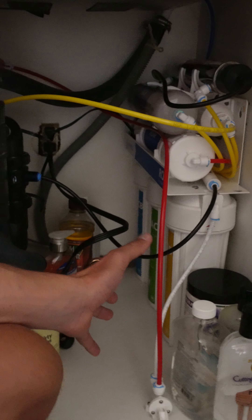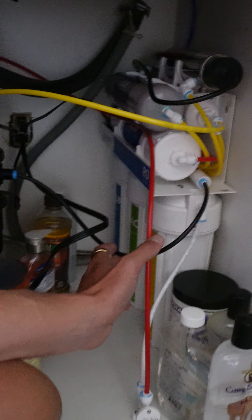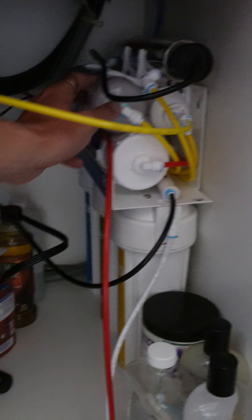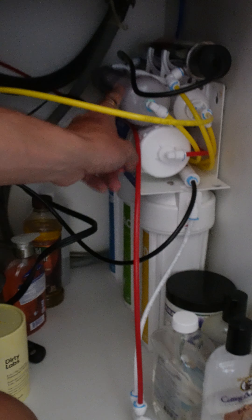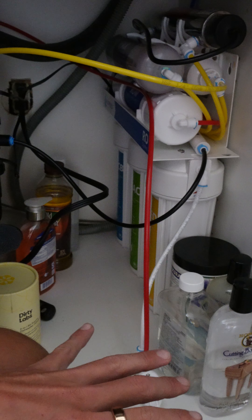Let me show you what is an RO system — a reverse osmosis system. Come down here, you can install an under-sink unit like this, which does take a little bit of technicality, but it's not hard. It took me like 45 minutes. There's just a lot of instructions, a lot of cutting these to the certain length. But it's super relatively easy — it just takes a little bit of time. Get a five-stage. This is a seven, which reintroduces more minerals and makes the water alkaline. I'm a little skeptical about how they reintroduce the minerals, so I wouldn't recommend the seven-stage. I would recommend five stages — that's all you need.